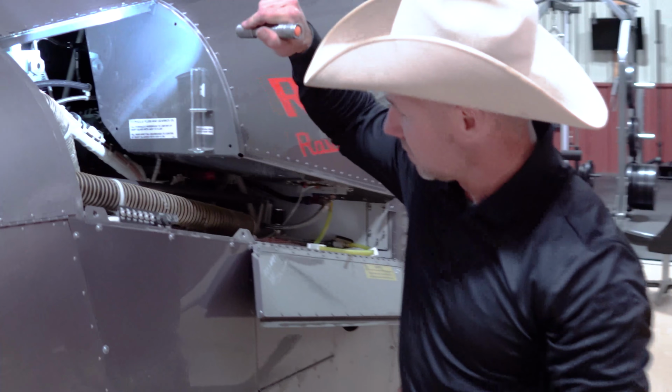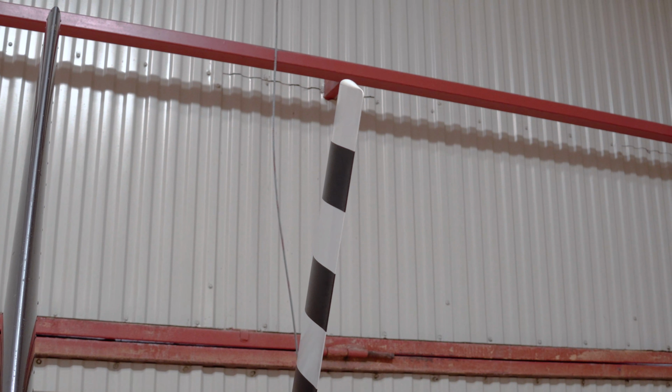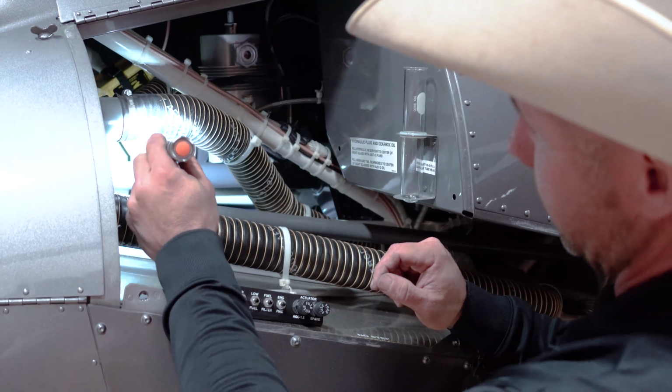Also, this is my push rod for my tail rotor. So I'm checking the movement on it, making sure that it's free and clear. This is your main drive shaft right here, okay? So I'm always looking right about there. Make sure there's not any metal fragments or spiral crack. If a mechanic or something hit it too hard and there's a crack in there, it'll break.